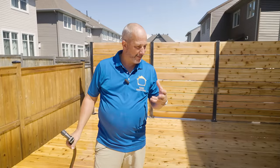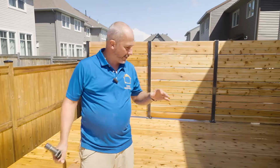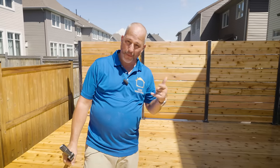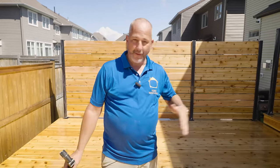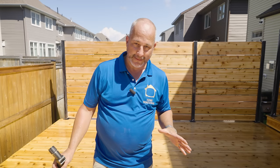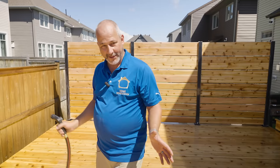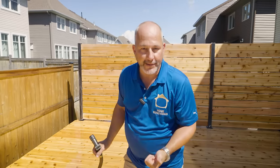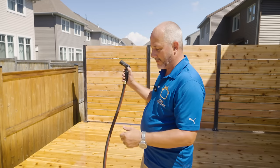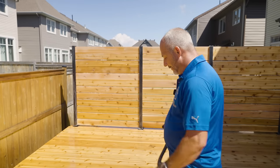When you get them ready, you're doing surface prep for a stain job. The stain lasts a long time, so you gotta make sure that you wash it, scrub it again if you need to. I don't care if you spend 3 weeks washing and scrubbing. Don't stain it until it's ready, until you're completely satisfied it couldn't be in any better condition. Because this is the only shot that you get of making sure that you're not gonna get a little white line from a piece of grass that was laying there, right? Or you're gonna have dirt showing up that gets compounded and magnified when the stain hits it. So just do your best.